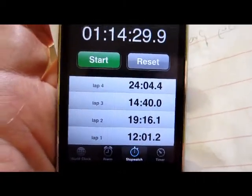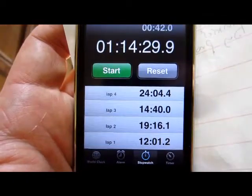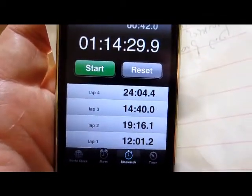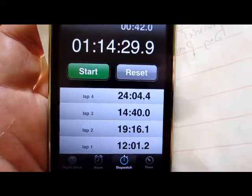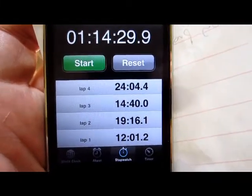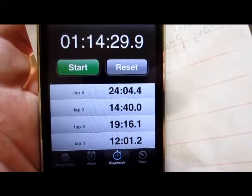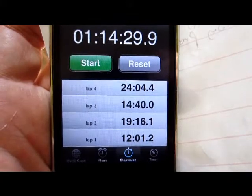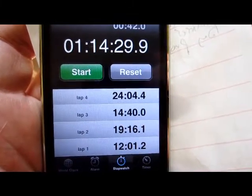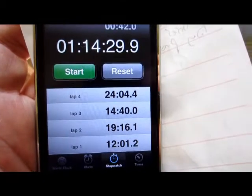So the idea being is it didn't have to hit a certain temperature. It stayed pretty constant and only ran for 14 minutes and 40 seconds. So then after it shut off, I ramped the temperature up to 70 degrees Celsius just to see if it was temperature related. And I waited on it, and in 24 minutes and 4 seconds, it kicked on and ran at 70 C. It only ran for 3 minutes and 41 seconds before kicking off again.